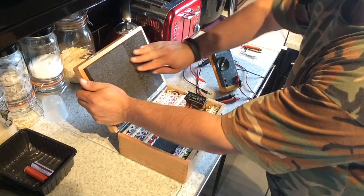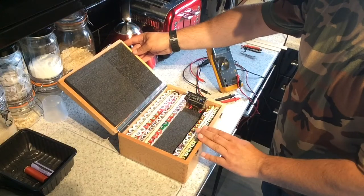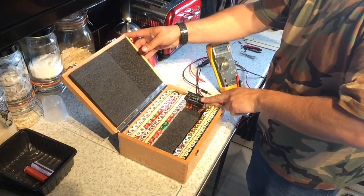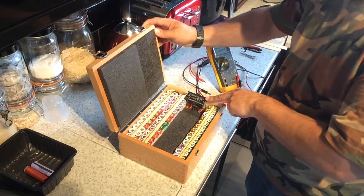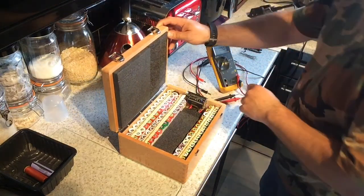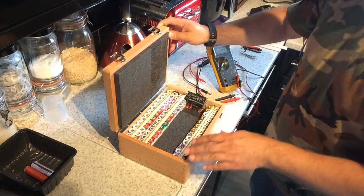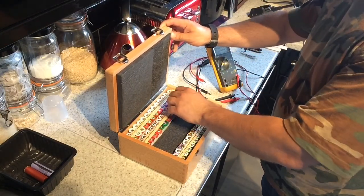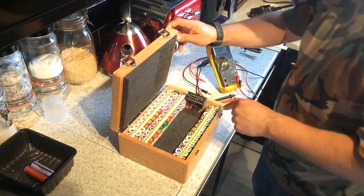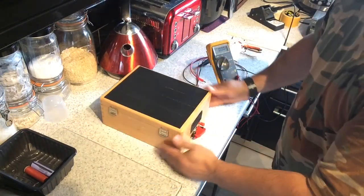I've put a little bit of insulation in there to make sure things don't move around inside the container. The switch is wired in, the voltage sensor is not yet wired in — it's a little bit more complicated. I think I probably need to put a few resistors in place to get it to read the correct voltage. I also need to put in a 5-volt regulator, so I need to find room for that somewhere in there as well.